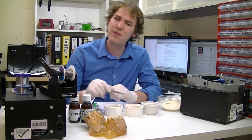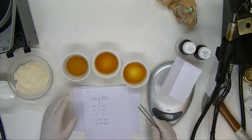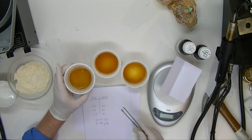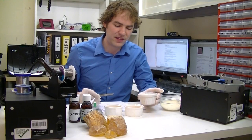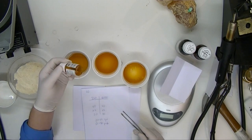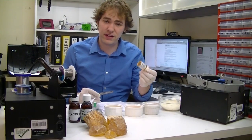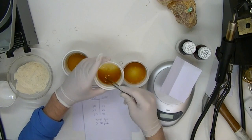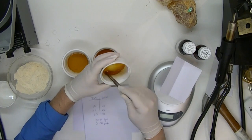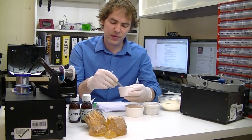Yesterday we tweeted pictures of making some examples to use in the video today. These each have a different concentration of rosin. This first one is only 40% rosin by weight — it's pretty thin. Flux doesn't have to be thick; the goo that we like a lot as a brush-on flux is actually very thin. This one is 65% rosin by weight, starting to get a bit thicker. This one's a lot thicker — it's 80% rosin by weight.